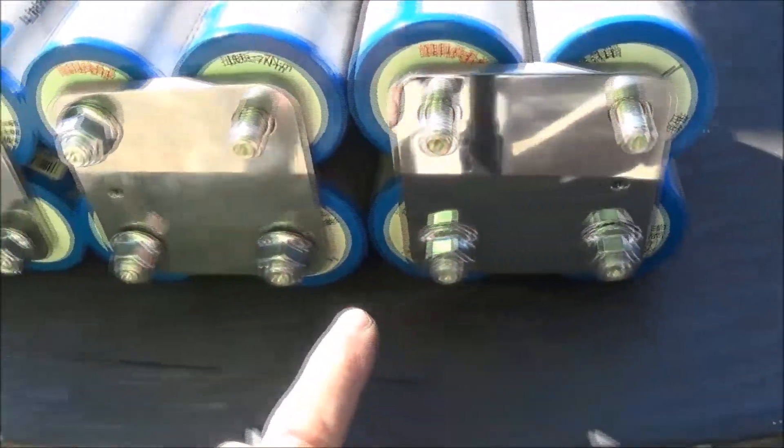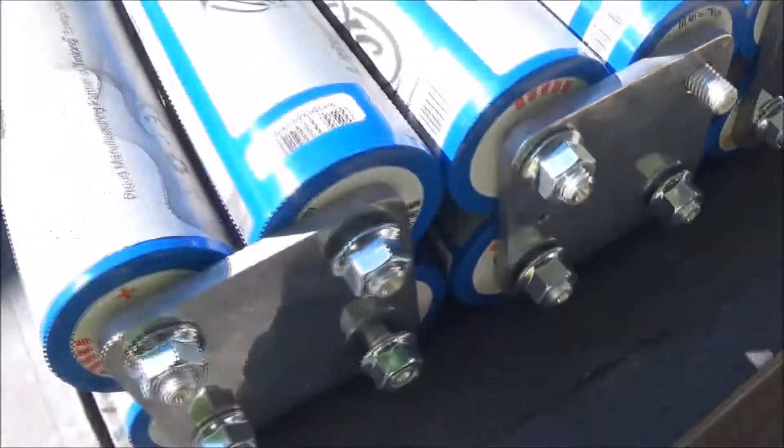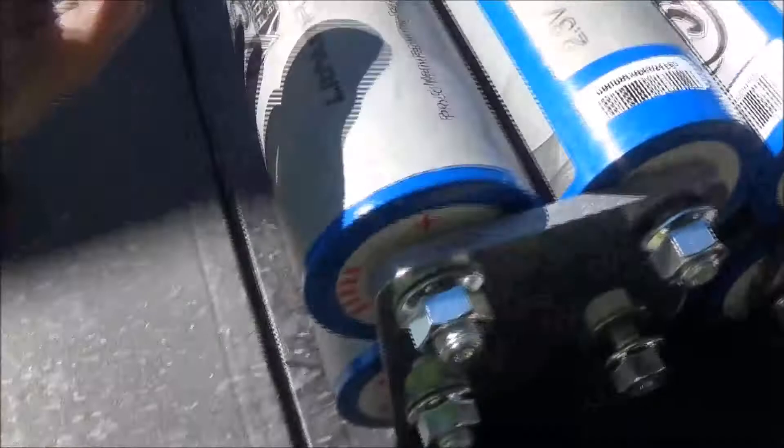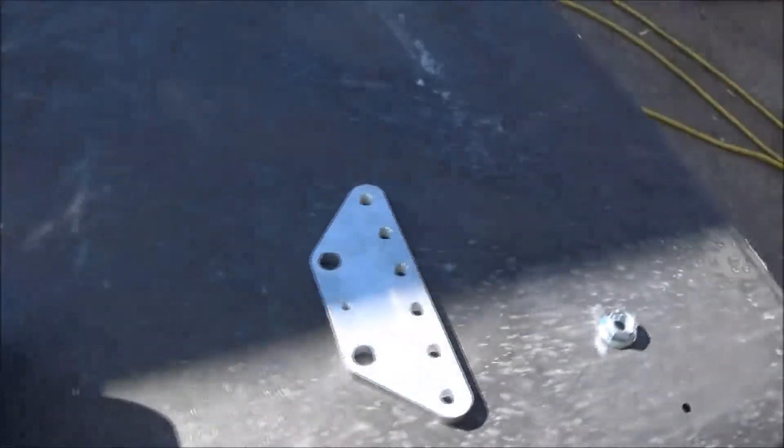The way I started this is I laid down my first six cells in series the way that they're supposed to go. I put my bottom plates on, put the nuts on the bottom plates — these are just hand-tight, they're not torqued down yet. Then I come up here to the next row and started putting the batteries in the way they're supposed to go, putting the plates on as I move down until I got them all in there. I'm not going to torque them down — I'm going to get a torque wrench that measures inches. I've seen too many of these things broke in the Facebook groups, and I don't want that to happen to me.